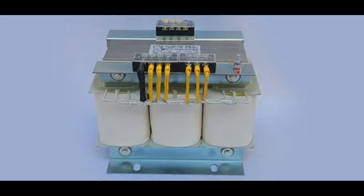Consumer electronics: home appliances — used in appliances like refrigerators, washing machines, and air conditioners to provide electrical isolation and protect electronic components from power fluctuations and electrical noise. Audio systems — ensures clean power delivery to audio amplifiers and components, improving sound quality and reducing interference. Isolation transformers play a crucial role in these and many other applications where electrical isolation, safety, and noise reduction are essential for reliable operation and protection of equipment and personnel. Their ability to provide clean and isolated power makes them indispensable in modern electrical and electronic systems across various industries.